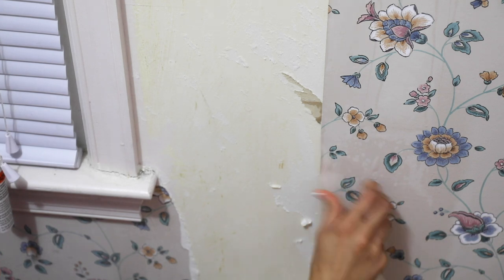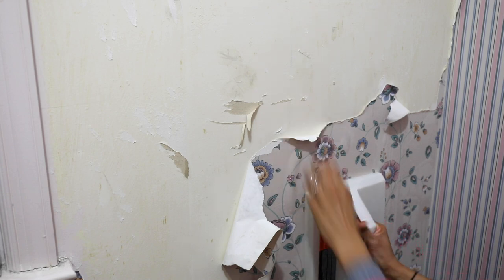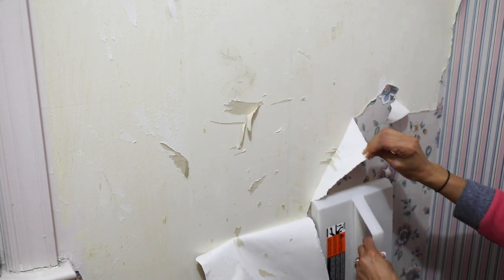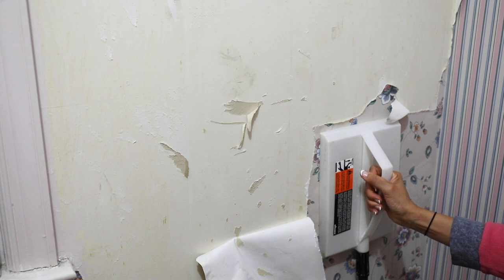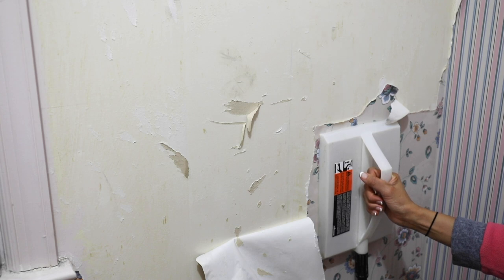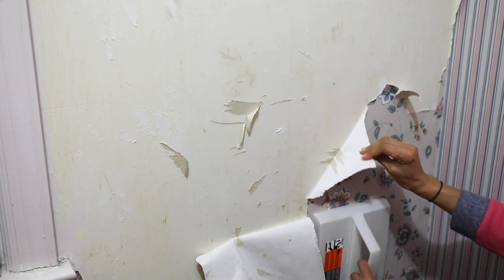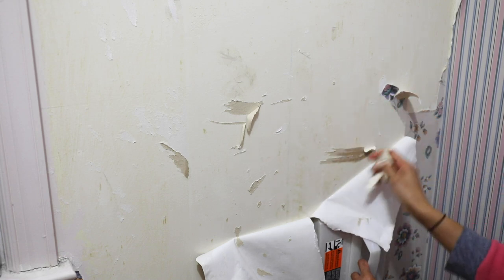Sometimes we go a little faster because we just want to get this stuff off. You'll notice that the wallpaper will start to bubble and pull away from the wall — that's what you want, that means the glue is coming off. When I pulled back and saw a brown paper bag area, that told me there were spots not completely ready to separate. After leaving it on for a few more seconds, it was time to pull it off. You won't completely prevent paper bag areas — there will be some, I guarantee it. But I will show you how to fix those and you won't even notice them.